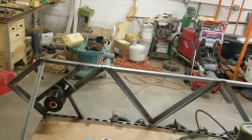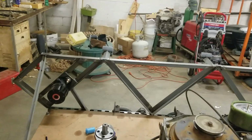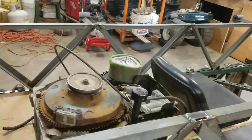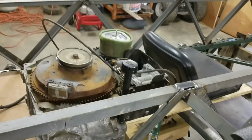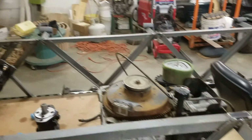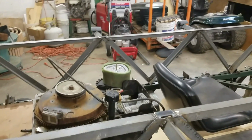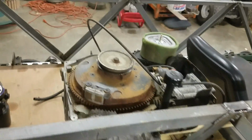Like I said, last video I mentioned that propane tank over there, and that's actually way too small. I thought that the rule of thumb for sizing the hydraulic tank was 30% of the GPM of the pump, it's actually 300%. So there's a little bit of a difference there. 5 gallons isn't going to be quite enough. I'm going to have something that's like 20 to 25 gallons, and I'll make that in a later video and show it in detail.